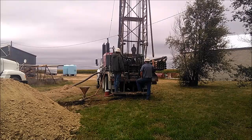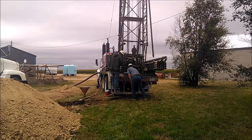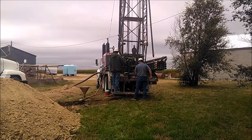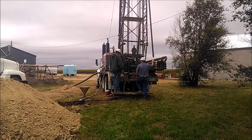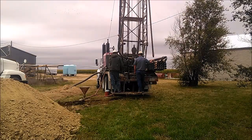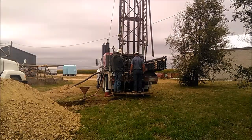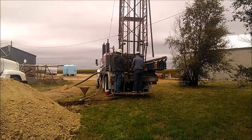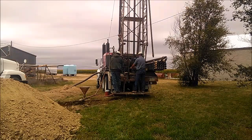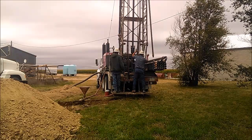In our case, most of our wells develop relatively easily, we're in areas that are capable of producing a lot more water than what we need, so we really don't need to spend an excessive amount of time trying to improve something that you might gain a couple feet of drawdown. The biggest thing we do to develop is actually to precondition the hole with flushing the water through it. Other than that, we drop our test pump in it, which is just a submersible pump, and overpump the aquifer a little bit, which does clean out some of the sand and fines, but mostly it's just getting the water clear. There's really not a lot of actual development goes on when you're just overpumping.